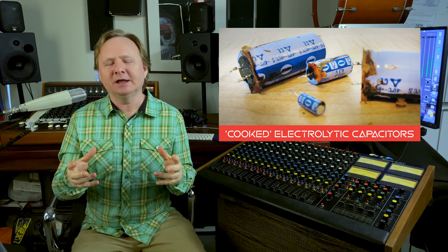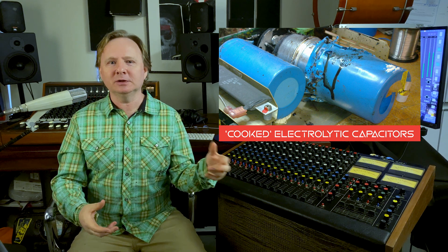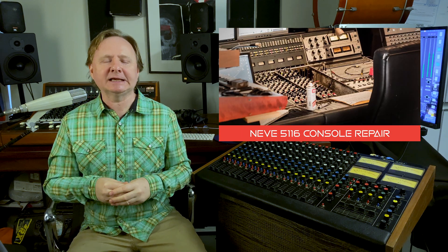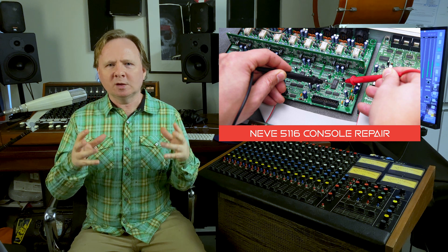The negative was that amount of heat inside the board from the ICs was literally cooking the electrolytic capacitors. You've probably heard people talk about recapping — that basically means replacing electrolytic capacitors. For a Neve console that was very expensive. In Australia, major networks like Channel 9, Channel 7, and the ABC were buying these in the 80s. It was not uncommon for channels to need recapping very quickly — sometimes the entire board within three to five years of use. These boards were on all the time, switched on all the time, that heat dissipating constantly.